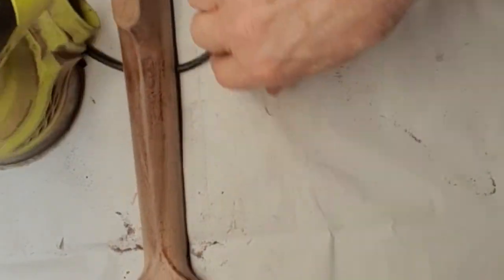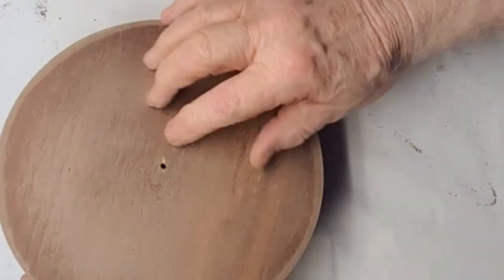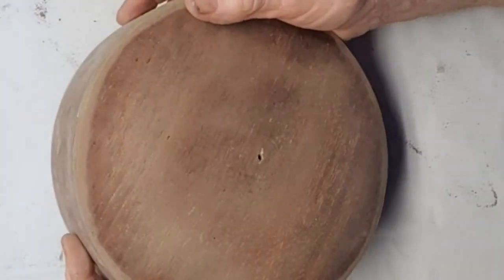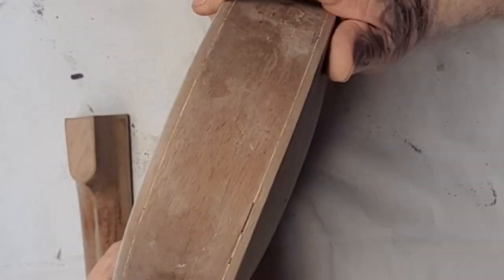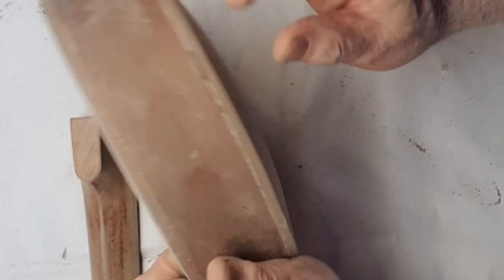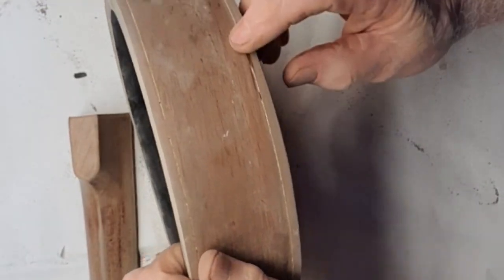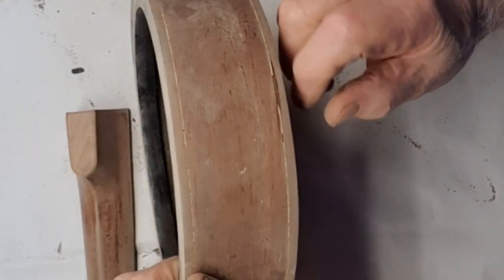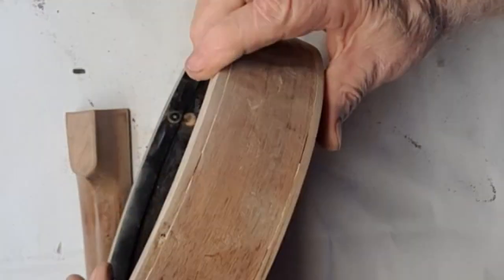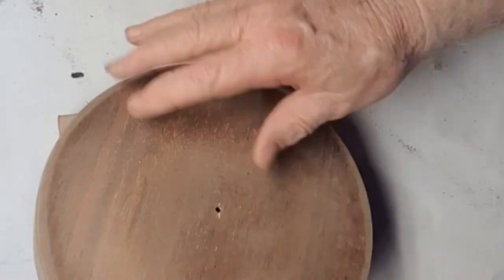When you're sanding them down, you don't have to take everything off. I'm going darker than this. I'll do this walnut, so that's good enough. All we've got to do is, we've got this area here that had the binding in it. What I'll do, I'll go over that with some sanding seal. I'll go over the whole lot with sanding seal, in fact.